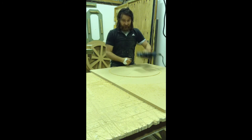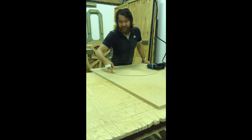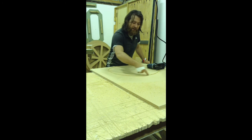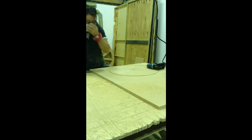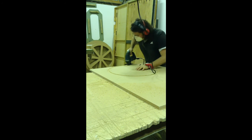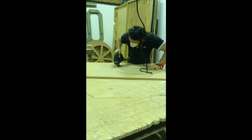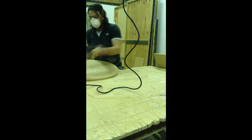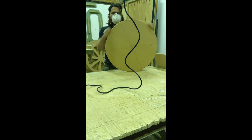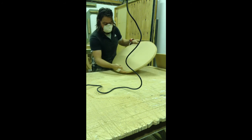As said at the beginning of the video, a jigsaw does come into it. This is just for ease purposes really — we can cut to just outside the outside perimeter of the circle, just to make it easier for the router to cut the excess away. So that is what we shall do. Then we are left with the circle, which is very bumpy on the outside — which would have happened if you used just the jigsaw. However, on the step made by the router, you have a perfectly cut circle.